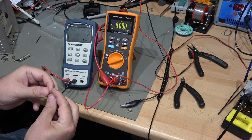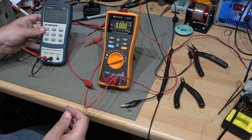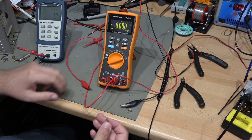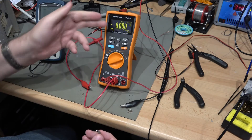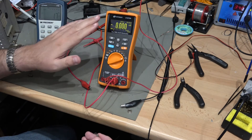This is a 35 volt capacitor, so I'm going to connect up to this meter — my normal voltmeter on its milliamp range, which can measure down to a microamp. There's a tiny offset on the meter itself which I've nulled off, so it's reading zero.